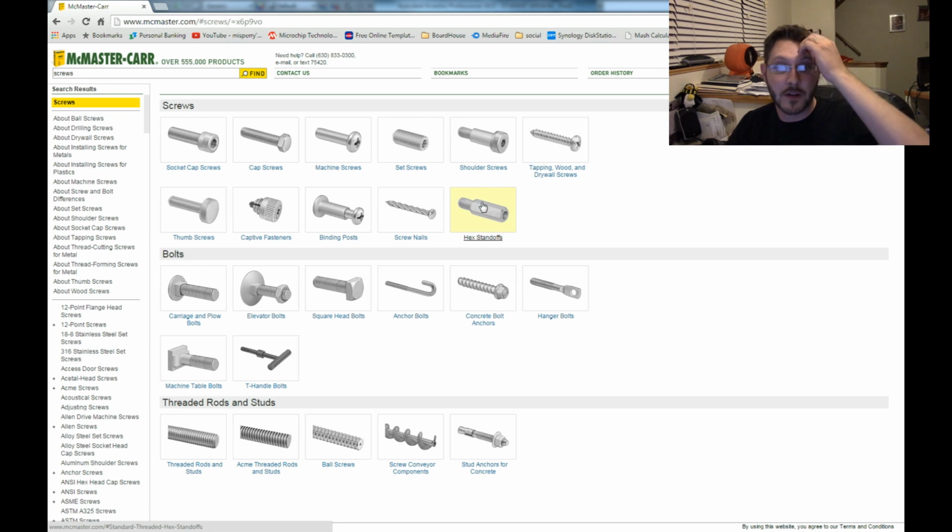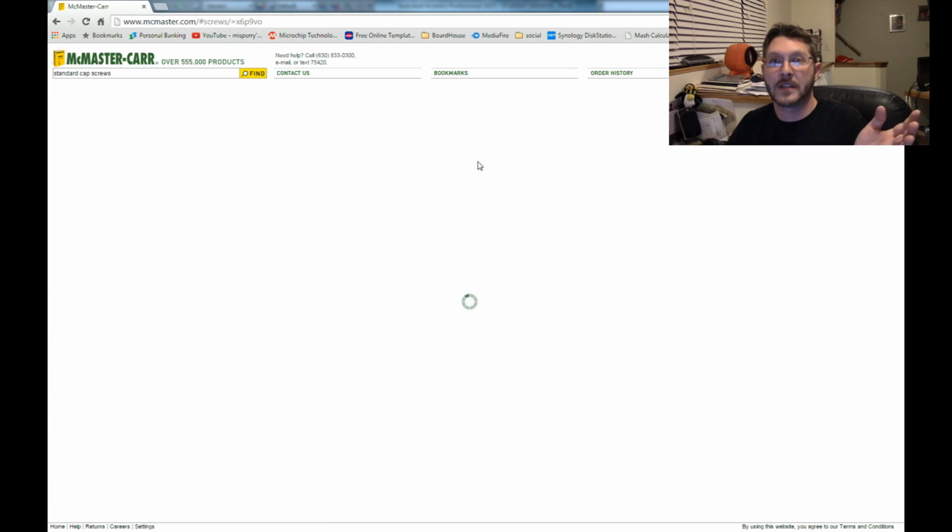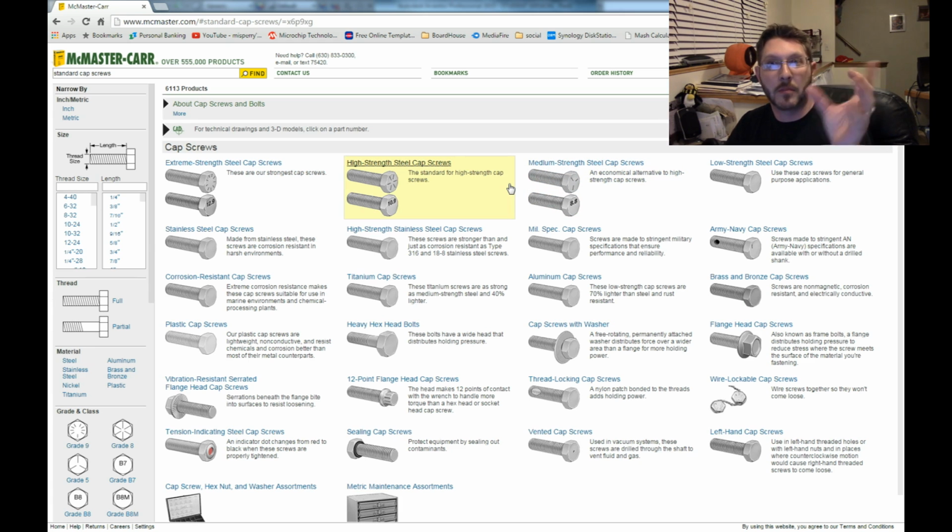Stuff's gonna fit the box. Especially if you can get a pre-made box off the shelf. If they have a 3D model of it, like I know Hammond Enclosures has 3D models of all their enclosures. So get the 3D model, throw it into some modeling software, and model up at least just even the board outline, you know, just a big thick chunk. Measure the biggest part on your circuit board or something, and just make a block, just a chunk, you know, that's all you need to do in your 3D modeling software, and put it inside that case and see if it's all going to fit, if anything's going to hit or whatever, or if that case is the right size for what you're doing.